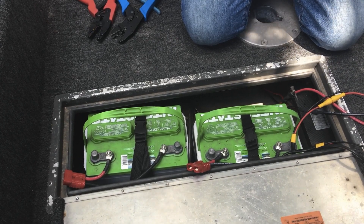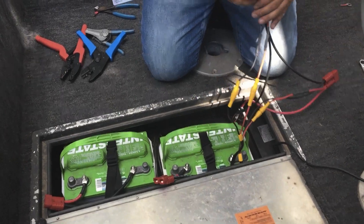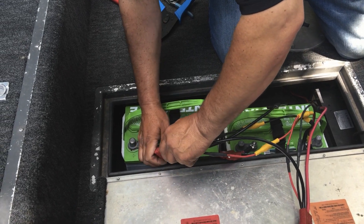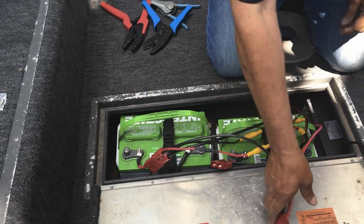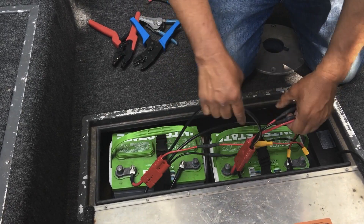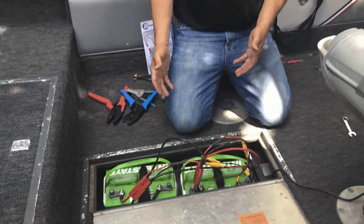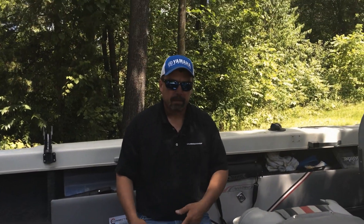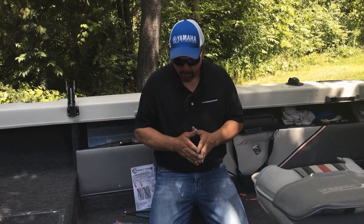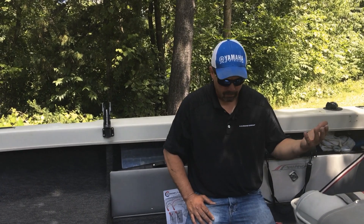Okay, so now I'm just going to plug it all back together and we will have our 24-volt connection with battery chargers all hooked up — like so, like so. And voila, we have a completed system. I now have the ability to unplug, pull one of these batteries out, move it to my fish house with ease, golf cart, whatever I need a battery for. I simply add a pigtail to the opposite end of where I'm putting it in, and I can have it out of there literally in seconds.